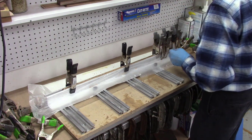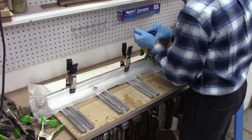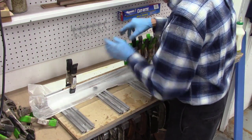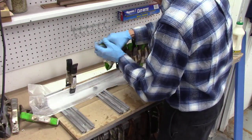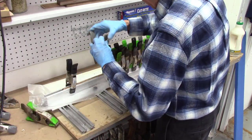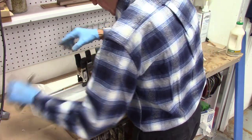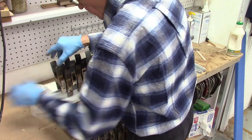To produce the perfectly matched herringbone patterns I use the wider strips. To glue up the wider laminate boards and inlay strips I use my glue jig system, which works much better for these wider pieces of wood — using the same processes described in the previous video on the inlay straight pattern pieces. After these boards are dry I take them to my edge sander and sand off the excess glue. The glued-up laminate boards will then be sliced in half using my modeling saw.